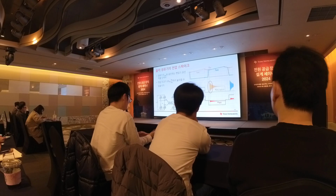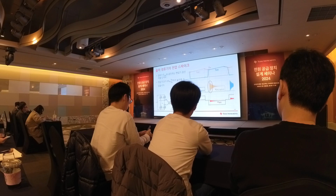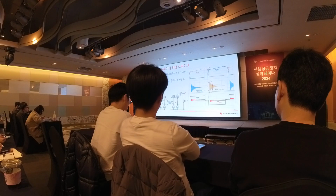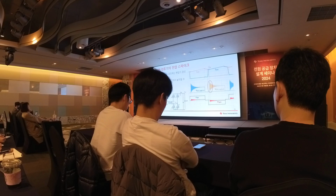So basically, if we want to design an efficient power supply using a lower RDS(on) synchronous rectifier FET, then we must find a way to limit the spike so that we can use a low RDS(on) to reduce the SR total loss, the conduction loss, right?